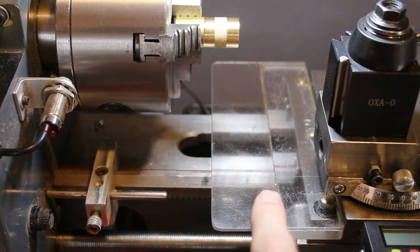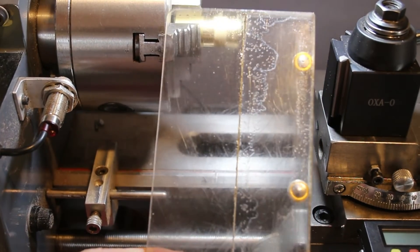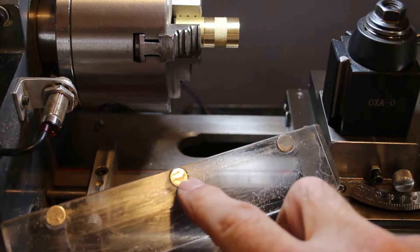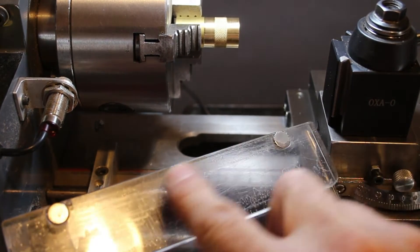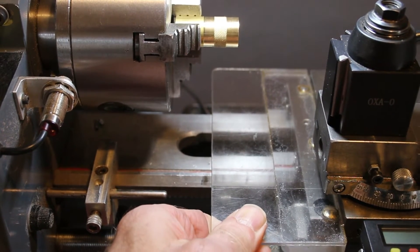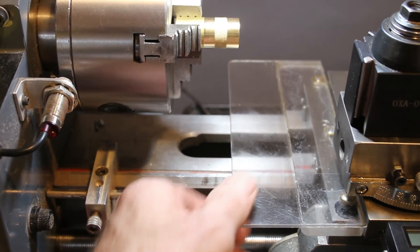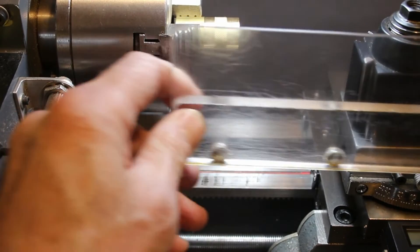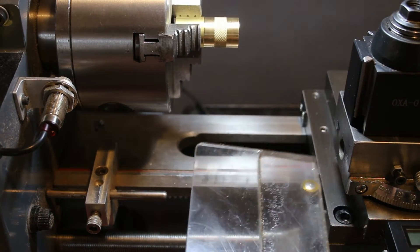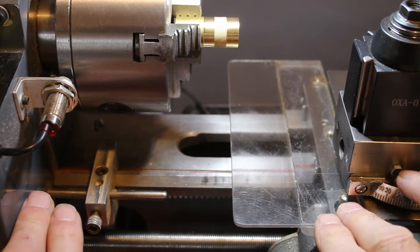Something I built fairly early on is this chip capture that is magnetic. It comes off — it's made of polycarbonate, so it's unbreakable. It has three magnets embedded inside, glued in with crazy glue, so they're right to the surface and also to the edge so that when I attach it, it goes up against the tool rest. It moves around with everything. You can also reposition it — sometimes I'll put it up this way so it'll catch chips that way. There are various designs for this and some people install bellows all the way across, but I didn't particularly like that — it doesn't fit well with my particular machine.